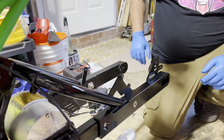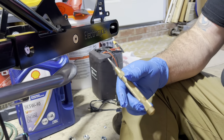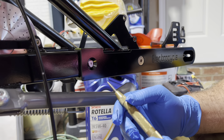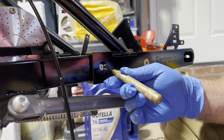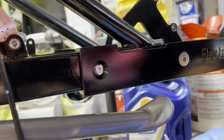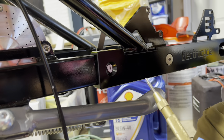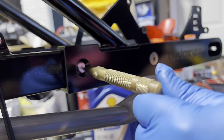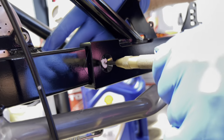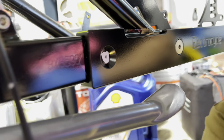Now we need to drill out this hole. You'll want to use a punch so your drill bit has somewhere to start. Get your eyes calibrated so you know exactly where the center is — if you put it off to the side, you're going to screw up. So make your punch mark right in the center. I'm going to punch a couple times and that is dead center right on.